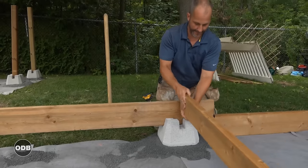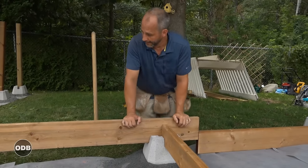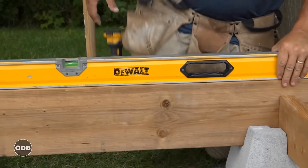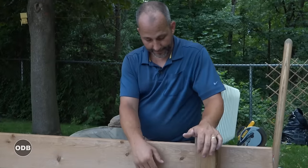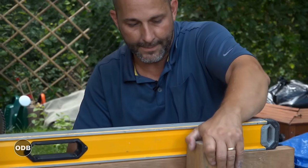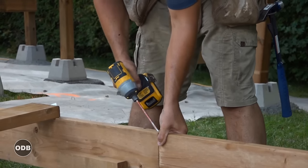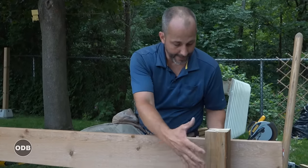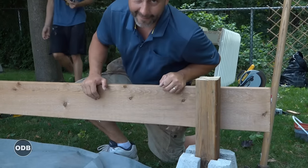This is a little bit arduous and tedious. We just need to get this laid out — we're going to use joist hangers for everything. We need to be significantly higher since we're doing a ground level structure, and the ground isn't flat so we can't just lay it on the ground. Over here, instead of adding three or four bags of limestone screenings, we're going to use the post in the block, attach a couple screws, and now we've got a level structure. We'll drill a half-inch hole, use galvanized bolt, nut, and washer assembly — that'll transfer all the load through the post, through the block, onto the clay, and now we're structurally solid.